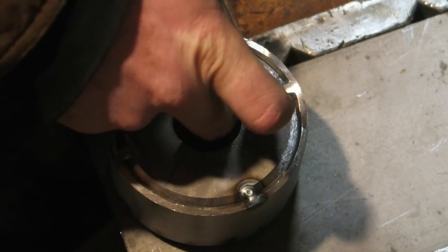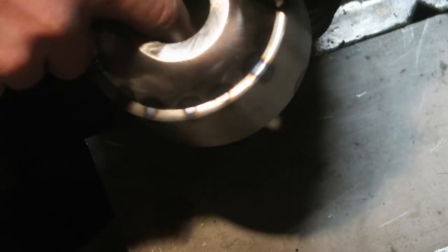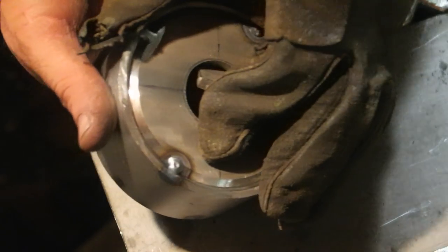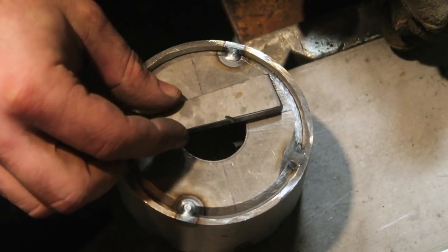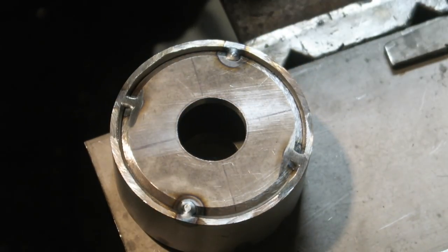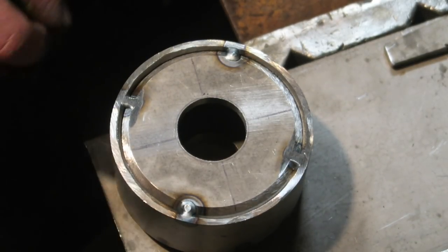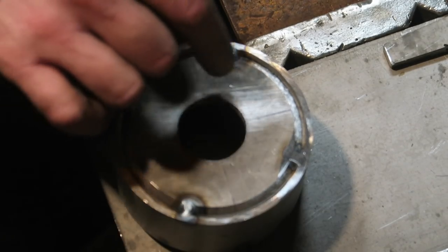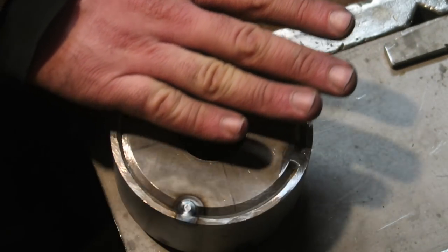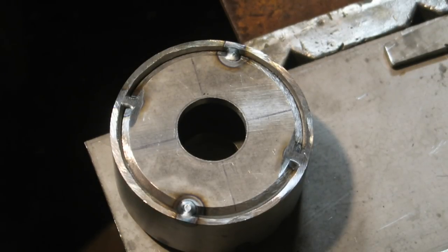Now, can I get the piece of metal out from the inside, or would it be a disaster? Oh, that's burning me good. Here we go. There we go. That was on the inside, flat across this, so I could clamp it down. But yeah, that would be the other thing. It would get awfully silly if for some reason I couldn't get it out after putting this on. So now I can weld this and be relatively sure that the plate won't warp. I might do four more tacks at the midpoints so that the plate will stay flat. Plate, that's what I was saying. Words, they're difficult.